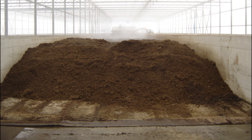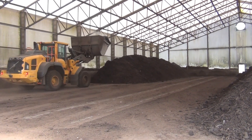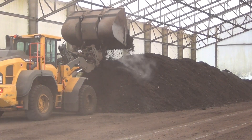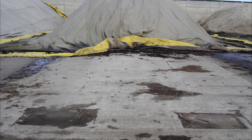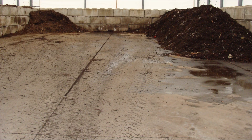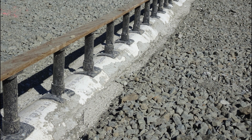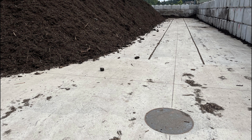The size of the pipes limited the length of the pile or bunker that could be made. In 2003, we tried two different types of aerated floors where the pipes were embedded in concrete. The first used a specially made fitting that could be mounted on either PVC or HDPE pipe — this type of aerated floor has stood up very well in the last 20 years. The second used PVC or HDPE pipes with saddles and uprights. Slots protect the spigots from loader wear on the concrete over time. We created a special saddle and spigot that was simpler and cost-effective. One needs to make sure that excess liquid entering the pipe can drain effectively without losing air pressure in the pipe.